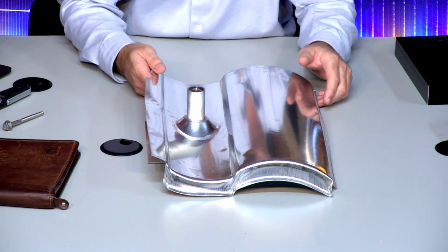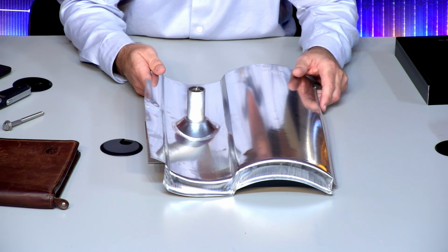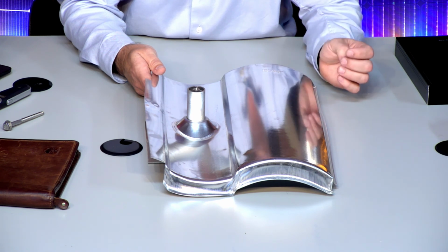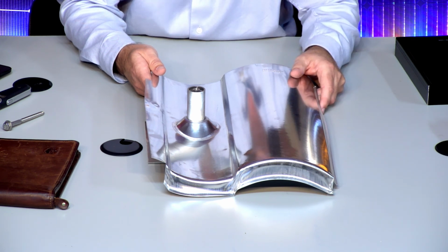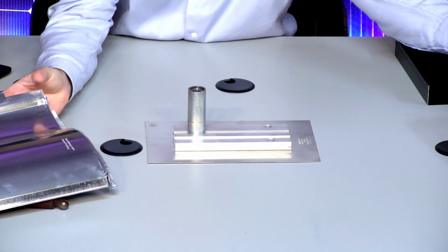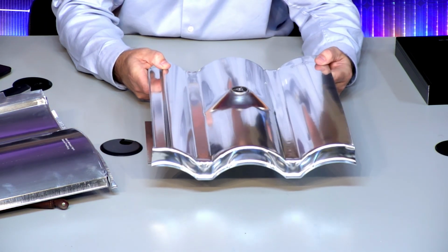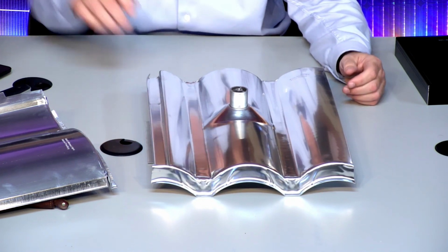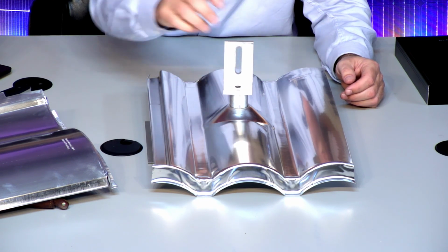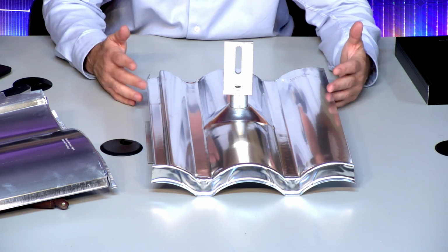Again, this isn't the only way of doing it. I wouldn't necessarily say this is the most common, but in my humble opinion, this is the best way of doing it. I know it's not going to leak. There's easier, cheaper, quicker ways of doing it. I just like seeing it done this way. Again, same thing with the W tile. It fits the same. Now, there's different size risers. This is a shorter riser, but you can see how that just barely fits through. But again, you just go ahead and put the tile or the L foot on here, and then you're off and running. So your L foot bolts on top of that. That's now mounted to your roof. It is not moving. This is setting up here.